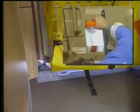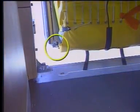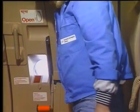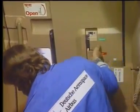Set the door control handle to the open position. Make sure that the control shaft levers and the telescopic forks on the door have engaged correctly with the girt bar. Set the door control handle to the closed position and set the emergency control handle to the armed position.